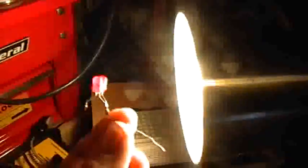And I don't know how to prove that to you except show you where the flat spots are, because you can't see into the LEDs, or can you? Maybe you can, I don't know. The cup's the cathode. So there's the cup facing to the right on that LED, and there's the cup facing to the right on that LED. So as we turn them around, they're mirror imaged, right? So those two are back to back, anode to cathode, with a dropping resistor on one end.